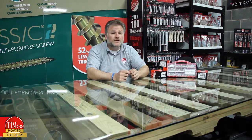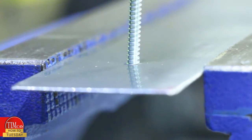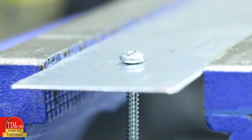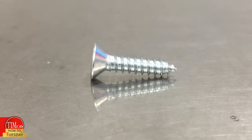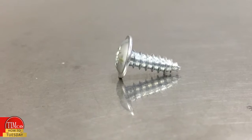The products themselves are manufactured to BS4174, so have a 60-degree self-tapping thread for a fantastic tapping ability. We stock a comprehensive range including a pan head to improve clamping, a countersunk with discreet finish, or a flange head when clamping is required with a low profile.